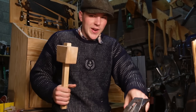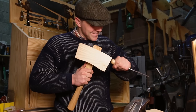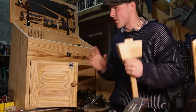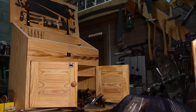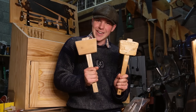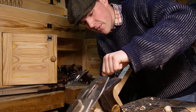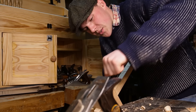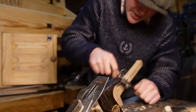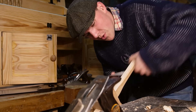We need to round out the handle but it feels fairly good and very lightweight, which is kind of what you want. Nothing like this monstrosity — yeah this is a novelty item. But I can see myself using that. To round out the handle I'm just going to take the spokeshave and count how many times I go on each side — I'll do six passes on that side and repeat on the other side, doing that on all four corners. Of course then we're going to bring along a sanding pad here just to remove some of those tear out patches.